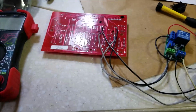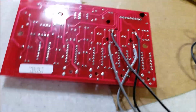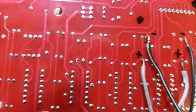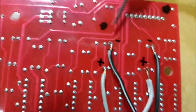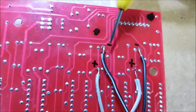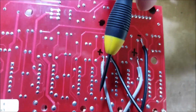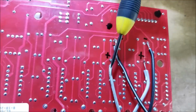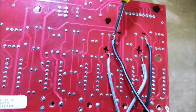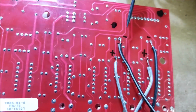Well, as you can see, I got the board back out, where I can show you things a little bit closer, what we did. Of course, you can follow the traces on the LED. That's the top LED right there for when the tanks are full, and that's the negative side and the positive side. All the LEDs use the same positive. You can see the trace. They're all tied in. It's the negative side that gets the voltage change that actually turns the lights on and off.